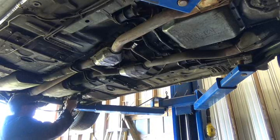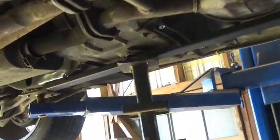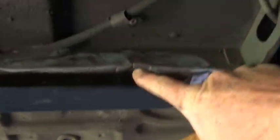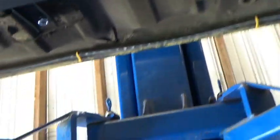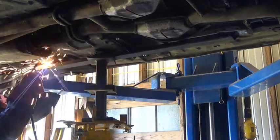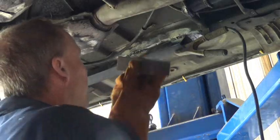Back to overdubbing. I'm grinding everything I have to weld to so I have a nice scuffed-up piece of metal. Getting paint, debris, and junk away. Then I used my brother-in-law's transmission jack to hold that bar in place and tapped everything square with a hammer. Once I got a nice snugness so it wouldn't move, I began tack welding. Once tack welded, I got the transmission jack out of the way, ground down the weld — you can see I welded pretty much all the way through — then ground off the rough spots.